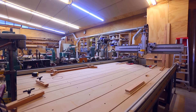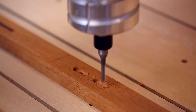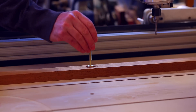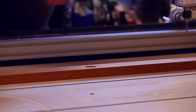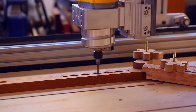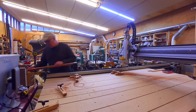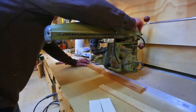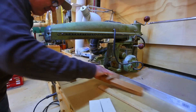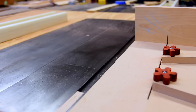The other critical piece is a stop that allows me to make each segment the same length. That stop can't be part of the sled because it would trap the segment between the stop and the blade, but it also has to stay out of the way of the new bed section. I'm making two strips of wood — one with a hole and one with a slot — the piece with the hole goes on the bottom, the piece with the slot on top, letting me slide the top piece to set the stop length. It needs a little runner to go in the table saw slot.